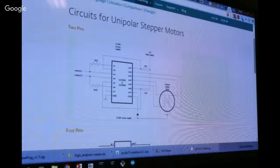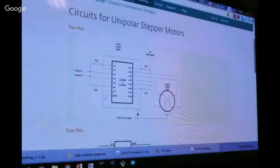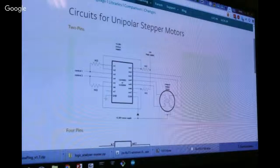What if the Arduino board goes first? No, don't do it directly to the Arduino. If you're going to do it without an H bridge, do it with transistors. I have a schematic for it from last week. For the small motor in the kit, you can actually run it directly, and it doesn't draw so much current that you would blow anything up. But a bigger motor definitely needs current protection. This one is just a single transistor, and that will only let you run it forward.